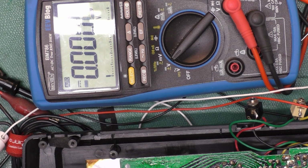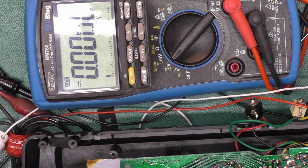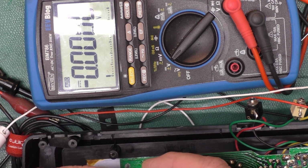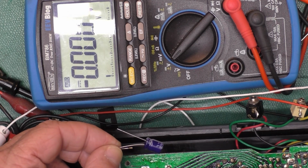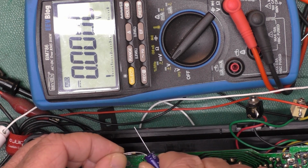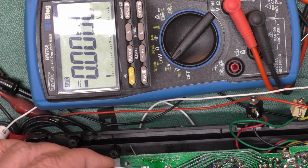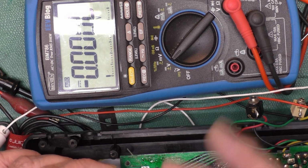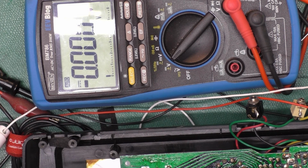what we can do is put a capacitor in series with the output, not from the output to ground, but in series. So on the positive side, we'll have our video output signal like this, and then this will go out to the output itself. And the capacitor will charge up to that nominal DC voltage that's floating on and only let the AC video signal through. See this a lot of time in audio signals too.